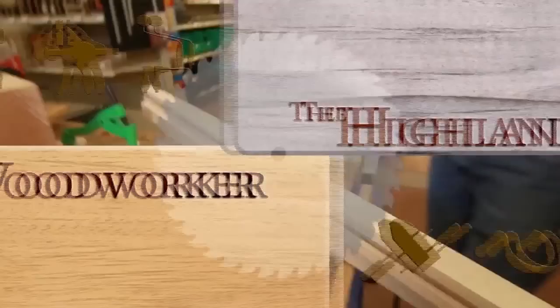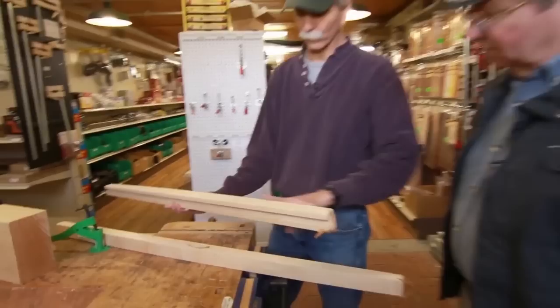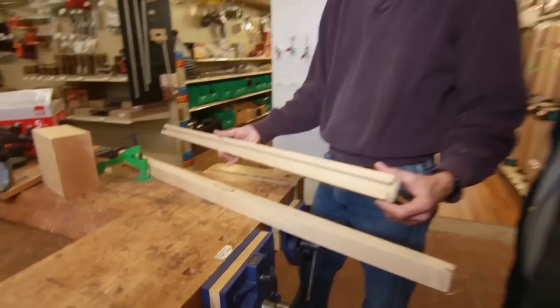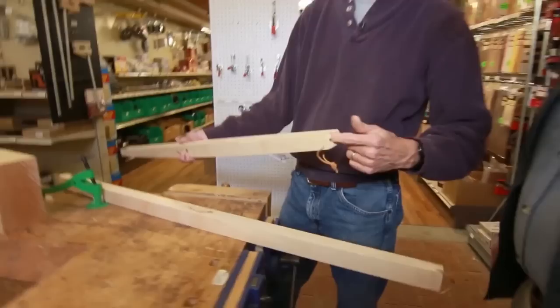Yeah, the Bowlclamp Clamping Cauls. They're sold in pairs, and it has a CNC machined camber on one edge, and that curved part allows you to put it down on your material, and then a clamp at each end is going to put pressure all the way across, and including right to the middle, so you can get good clamping pressure just with two clamps. That's a great idea. The little cutout here on the end, you can put an F-style clamp in it if you want to slip it right on in the end, or you can just have your clamp go right on top.